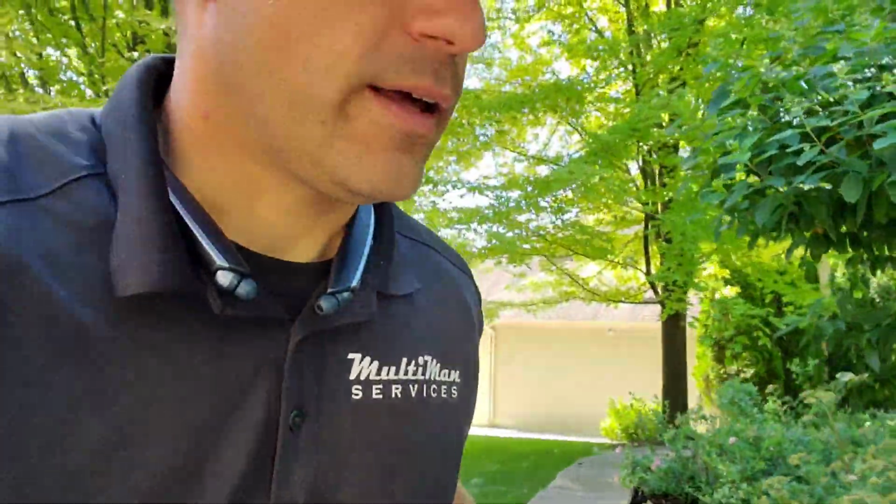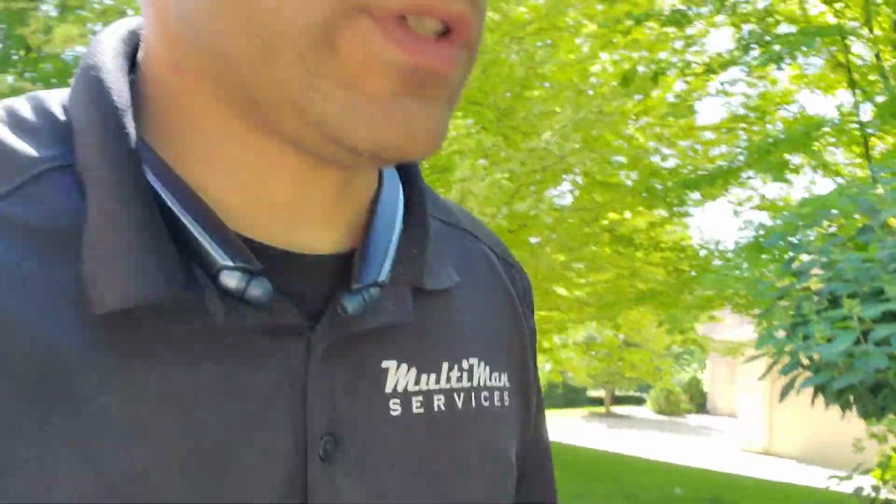So there were numerous spots in your house. The ridge cap was not installed properly. I was able to lift it up with my thumb. I'm supposed to see long 3 inch 16 penny nails, and I didn't see any of that. So, a couple of other photos.